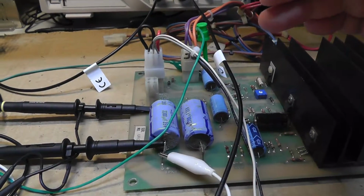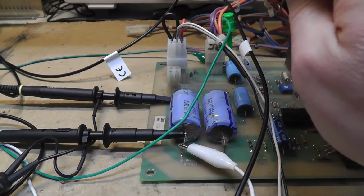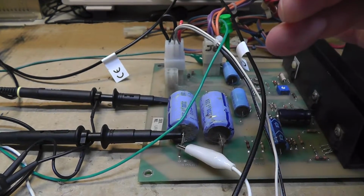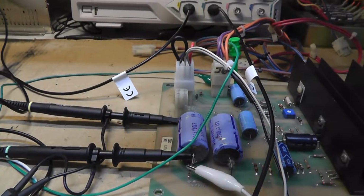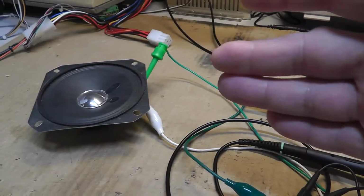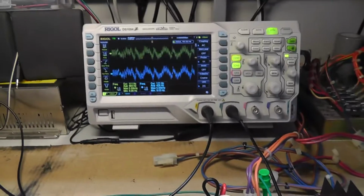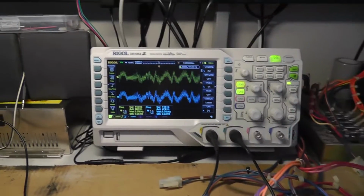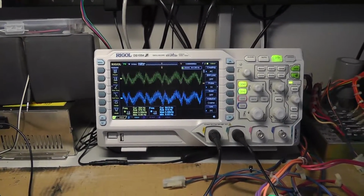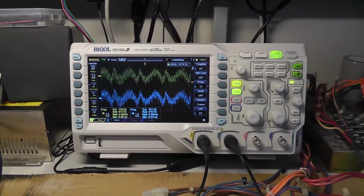But in some audio material they talk about how, if you didn't have these DC blocking capacitors and you sent DC current to the speaker, then the speaker coil could get heated up and waste energy, as well as probably ruin the coil. So anyway, let me disconnect the speaker here real quick. So what did I want to cover?